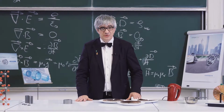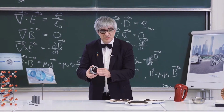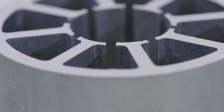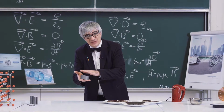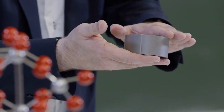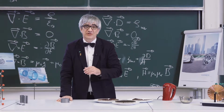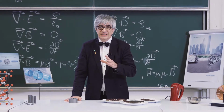First, we'll have to take a closer look at the electric motor. One part of the motor is the stator, which is not a solid metal component, but consists of many very thin laminations that must be bonded. Therefore, voestalpine uses a self-bonding varnish system. The new compacore backlack, which guarantees a full-surface inline bond that is suitable for large-scale serial production and makes it possible to produce many electric motors in a very short time.